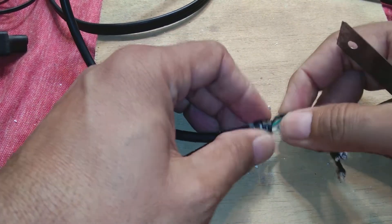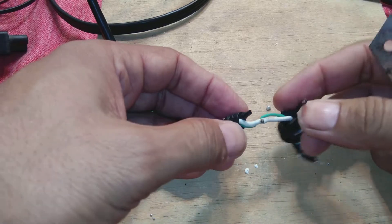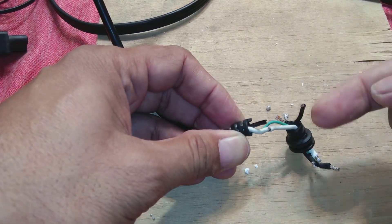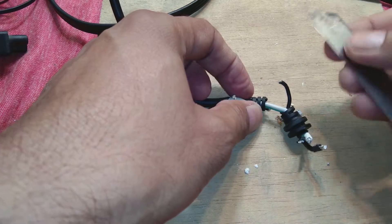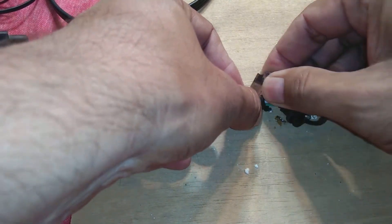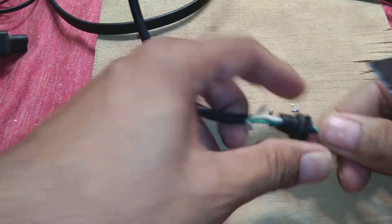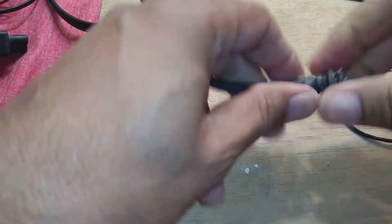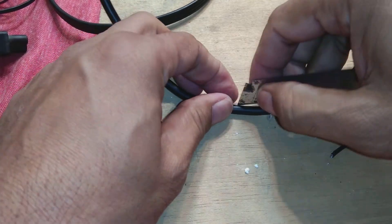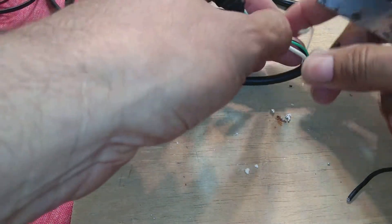The black wire - as you can see I cut it by hand and it came off. Inside the black wire there was no copper; the copper was cut already and it was giving no continuity. That was the problem. What we can do is take a blade or cable knife and cut this grommet rubber part, remove it, then push the grommet a little further back and bring new wire endings by splicing - scraping the insulation a little bit.